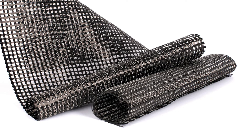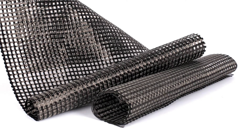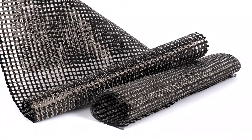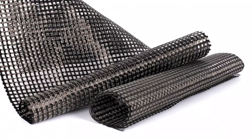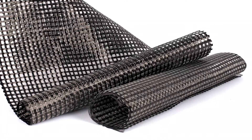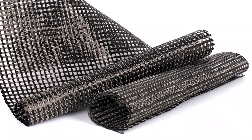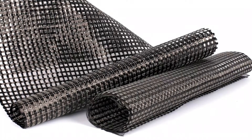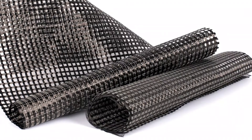For the preparation of the CMESH8484, you'll find the carbon fiber rolls of 15 meters in length and 1 meter high — that's 15 square meters per roll. Open the roll and cut the carbon mesh to the specific required length using scissors. Please remember when applying to allow a minimum of 10% overlap of the carbon mesh.